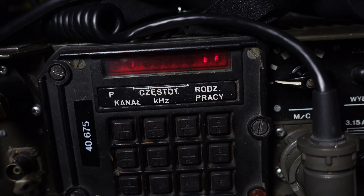Right now the radio is ready to be used. If we would like to get a quick peek at the status, we press the function key once — high power, channel two, noise squelch enabled, and the mode of operation. If I would like to see what frequency I've got on channel two, I click programming and select channel two — we've got our frequency, but I cannot change it because I'm locked into that frequency channel. So I have to switch to channel one, and now I can program channel two and enter any frequency I would like.